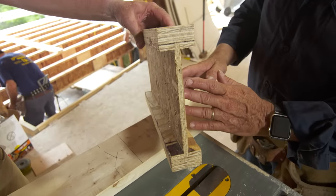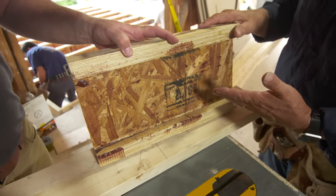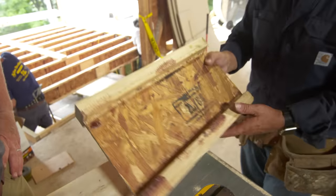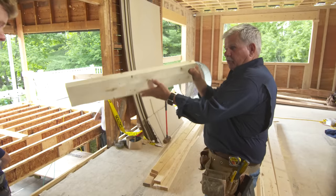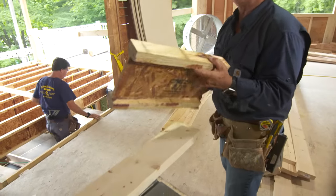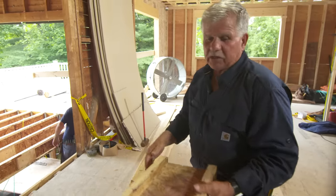You have a lot of flexibility with this material — you can drill big holes in it for running plumbing. And we have a floor that we know is going to be straight. With conventional lumber, you eyeball down the board to find the crown and flip it up the right way. With this material, we don't have to deal with that — it's straight no matter how you look at it.